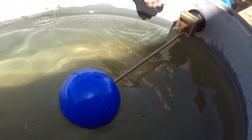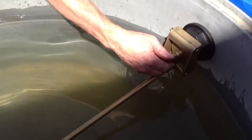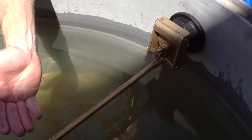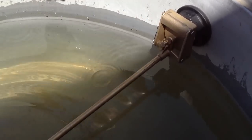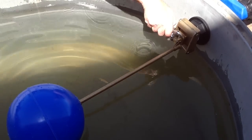For setting your water level height, you've got an adjustable screw here which you can move in or out. If you screw the thread out, that will raise your water level. If you want to lower your water level, tighten the thread, and then lock the back nut up.